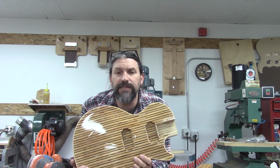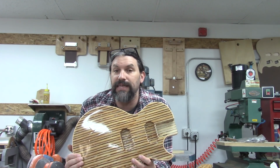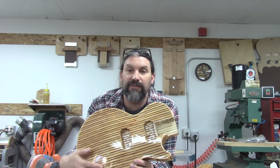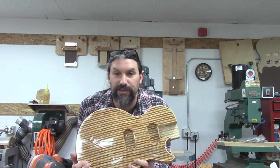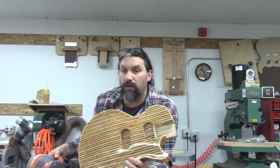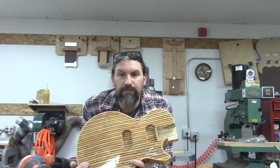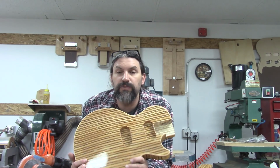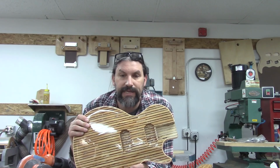The important thing to remember is that we always grind the sealer way back after we put it on there, so it doesn't leave that 1/8 inch shell of sealer. All we want it to do is level everything out. Now, when you're using plywood, you probably are going to have a thicker coat than you normally would. So we're going to go with a 220 grit sandpaper on my orbital sander, and just a piece of sandpaper and a block. If we need to get more aggressive, we'll probably go to like 150 in some spots. All we're doing though is promoting adhesion on the surface so that the next round of sealer will have something to adhere to.